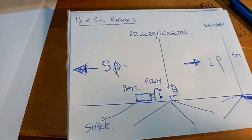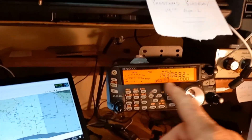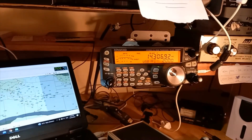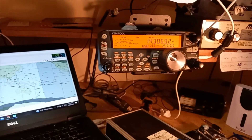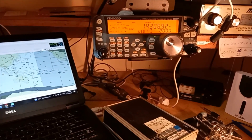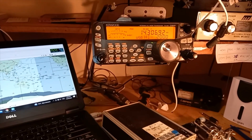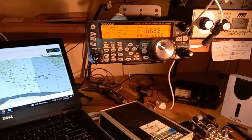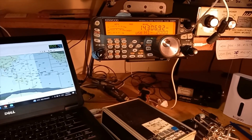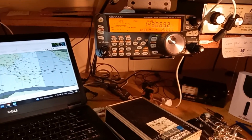So anyway, that's the basic setup and basic idea — nothing too flash, what you see is what you get. I don't know on the audio results and the S-meter what I can take from that exactly. I know a lot of people like to know front-to-back in dB, but as I say I'm just interested in forward gain for my long path operations. If anybody's got any feedback please share with me. Basic antenna — a couple of painting poles — and we've got a decent beam, two extra S-points over the single vertical, and it would seem a very nice front-to-back on the antenna. All the best, 73s, enjoy the hobby. I'm just going to have a cup of coffee and then back on the radio — hopefully catch up with some guys in the UK and Scotland because they were booming through last night. 73s, enjoy the radio. ZL3XCJ off and clear, bye bye.